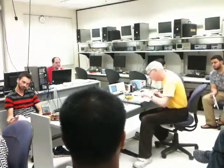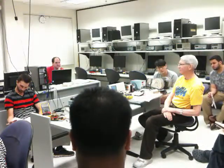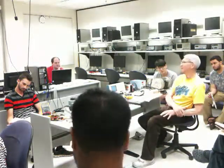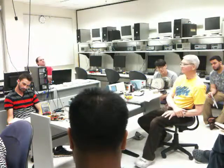Yeah. Okay. 136 watts. I don't have a bulb of that size. It's not standard, is it? But you still calculated the current, didn't you? What current do you expect? 1.13. So if you measure current on such a thing, it might say 1.1? Yeah. All right, we'll come back to that.